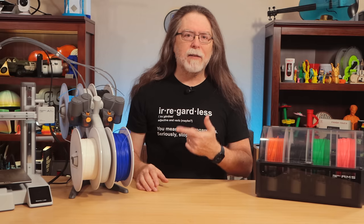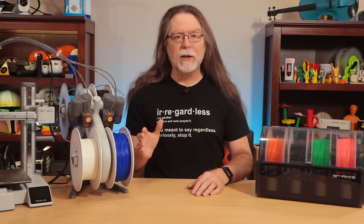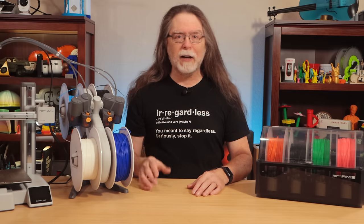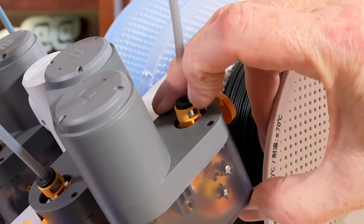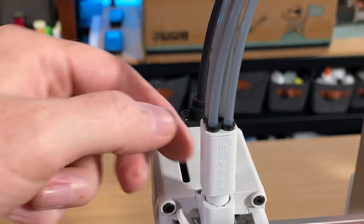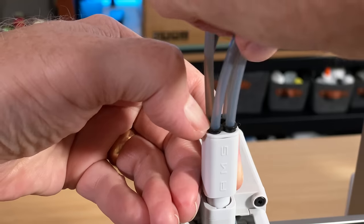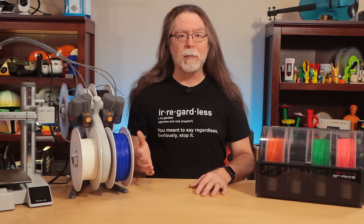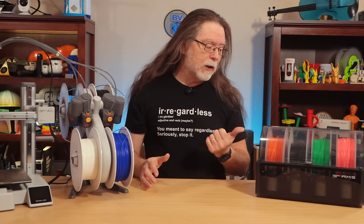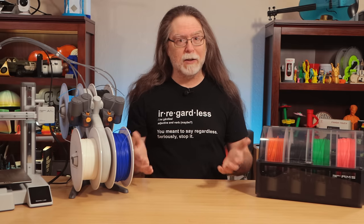But on my A1 Mini, I've actually had to cancel a print, because the only way to recover from the error was to turn the printer off and disconnect the tube that had the snapped filament in it. It's super easy to disconnect the tubes from the AMS Lite side, but it's a bit of a pain to disconnect the tubes from the 4-in-1 on the A1 and A1 Mini toolhead — those connectors do not want to let go of the tubes. I've had to do this on an X1 Carbon too, and while the full-size AMS is arguably easier to work on, it still requires disconnecting it from the printer, which means cancelling the print and turning it off.